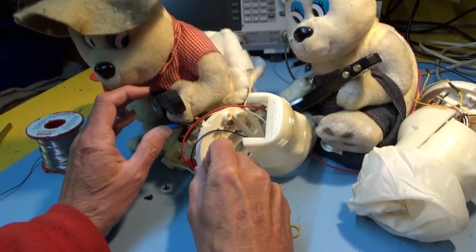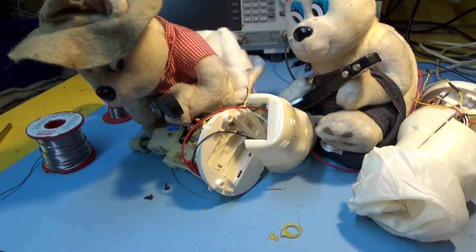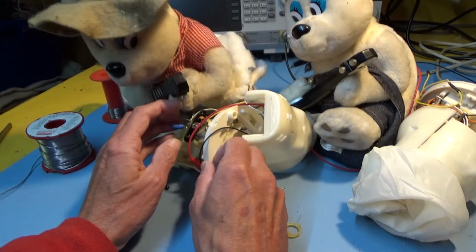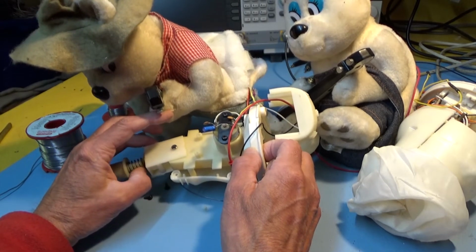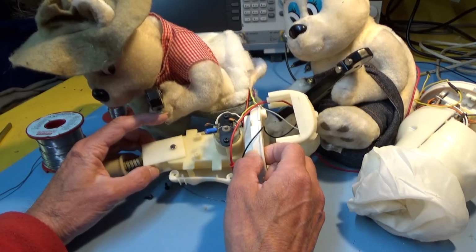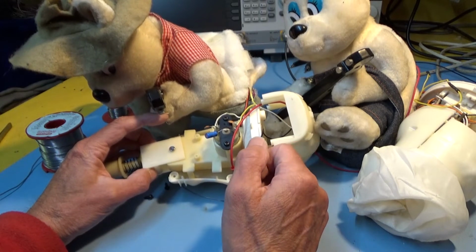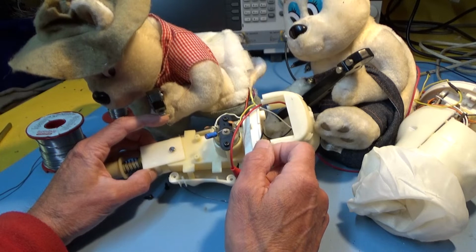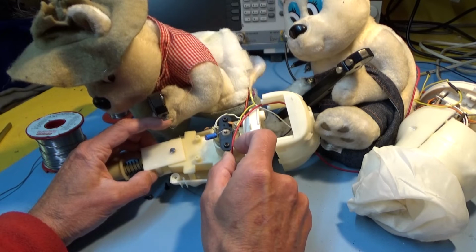But I was sort of poking around, and I stuck voltage across here, 3 AAs, so 4.5 volts. No response whatsoever. I had no idea how you turned it on. That's the main problem. But I did check the motor here, which moves this bit, which moves his head around, obviously, or body possibly, because I haven't put it back together yet to try it, but it does work. And the motor was open circuit, basically. So that was the first job.